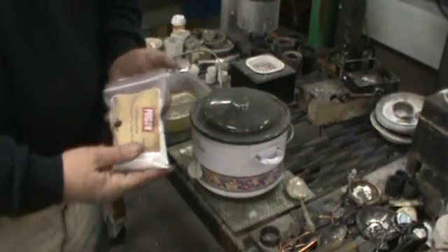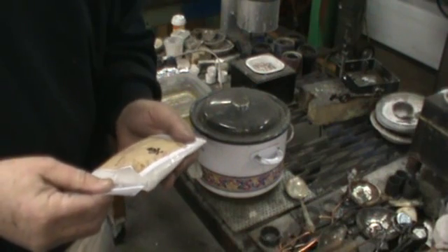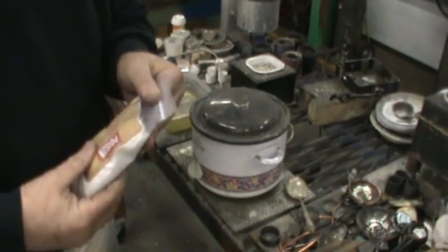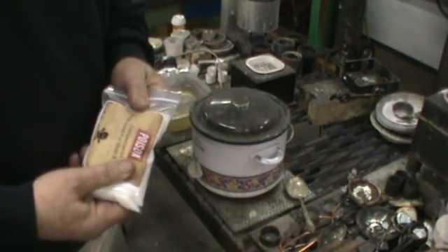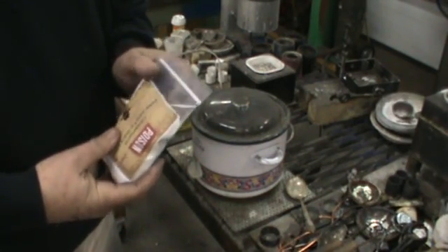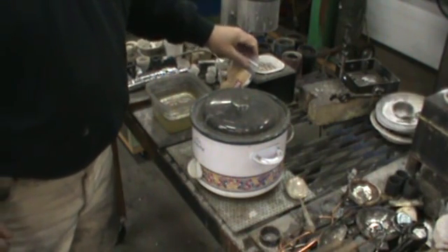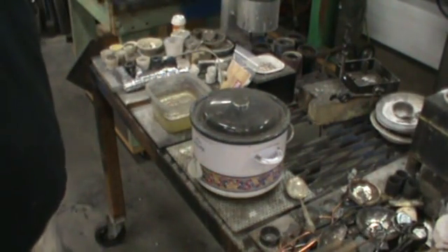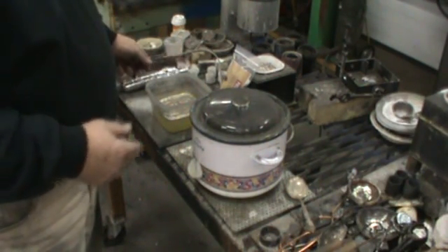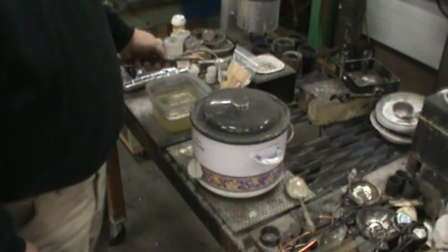It's a granular acid, white crystals. The safety on this — I would say you use this just like you would use your granular Drano and household cleaners. It is an acid. It's a combination of two dry acids to form this product, and it's non-explosive and non-flammable, which puts it far ahead of what used to be common. The pickle I use is for non-ferrous metals — for gold and for silver primarily.